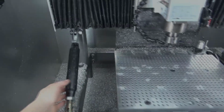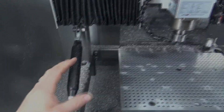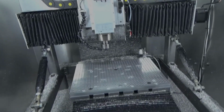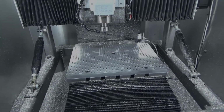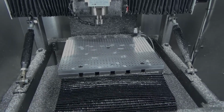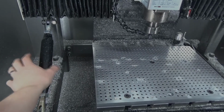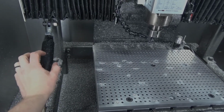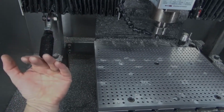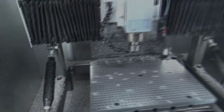I didn't even need any flats to run a wrench on, because it was very close right out of the gate. We're talking within a thousandth or two of tram error. It was a little tedious, but easy to just use these to either pull the towers in a little or push them up and out a little. So that worked great.